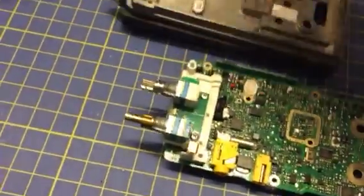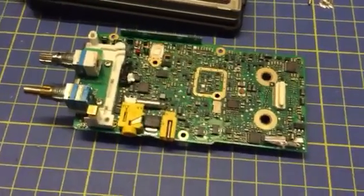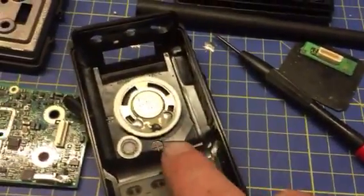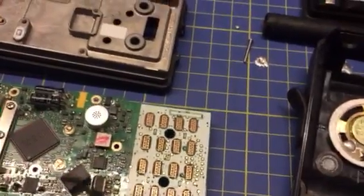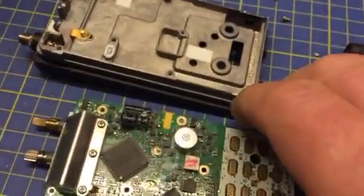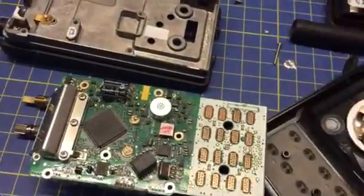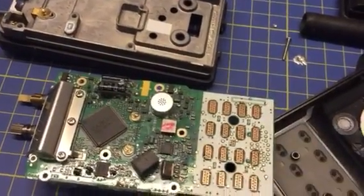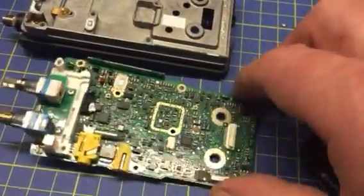I'm going to put it back together, but I'm not going to show you putting it back together because iPhones won't allow you to pause — that's why my videos are a bit jerky and a bit messy. Inside the case you've got the front case and the speakers there. The connection to it is two little springy terminals. Once I've done that I'll put it all back together and it seems to work fine now. This cap here is an inline cap, so you could check that first before changing the audio amp. Yeah, sorted. Done. Don't forget to put that piece back — that's why it ain't going to work.